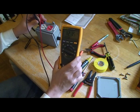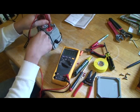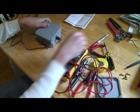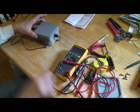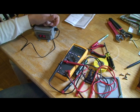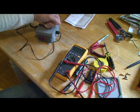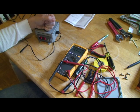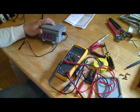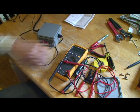Now you can see it's calling for cooling — since it's been more than 5 minutes since it last kicked on, it turns on immediately. You can see it's 120 volts on the cooling side. Just screw the cover down and it's done. This controller does hot and cold and can keep your beer within plus or minus one degree. You can cool it down, pitch your yeast, ramp it up — lots of options — all for well under 40 bucks. If you haven't done this, it's really easy, I'd go ahead and do it. I'm Darren and I'm out — hope you're drinking something good!